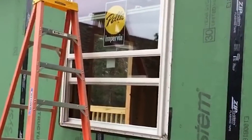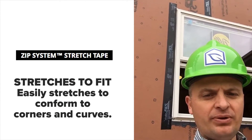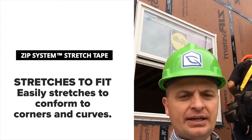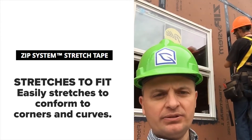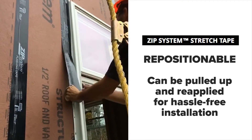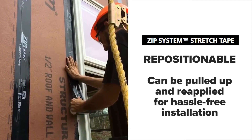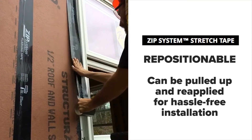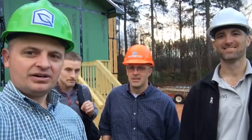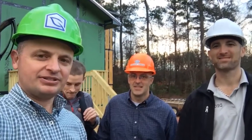Now the window is plumb and we're fastening through the pre-drilled nailing flanges. Then we do ZIP on the sides and on the header. Here we went up one of the window jambs with the ZIP tape going all the way, extending over the header. We're fastening the window to the sheathing before taping it up. The ZIP tape is an acrylic tape — it needs to be applied with pressure in order to bond to the sheathing. Apply it straight and then roll it. That's a wrap for today — we've got Deco Flash, Huber Engineered Wood, and Pella. Stay tuned — it was a very fun and information-filled day.